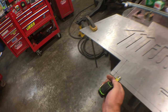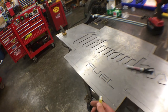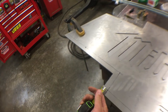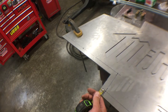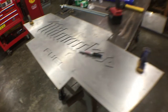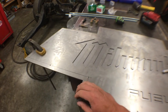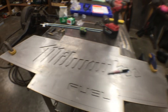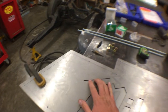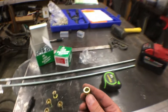A lot of framers will hold the tape measure with their hand and scribe the edge. Most tape measures have that little notch — you put the head of a pen right in that notch and hold your finger lightly on the edge. That's a really quick way to mark edges of wood, sheetrock, hardyboard, or metal. This is actually 16-gauge black iron steel, so it's not super thin, but with thinner metal it'll cut you easily. Always probably be wearing gloves.